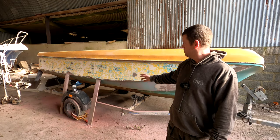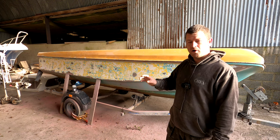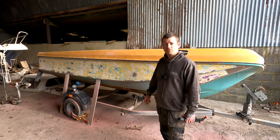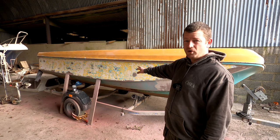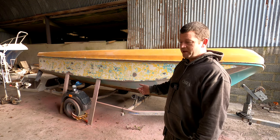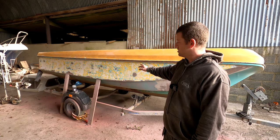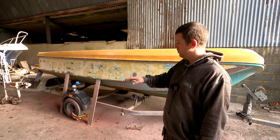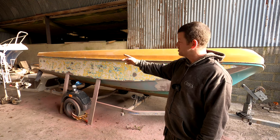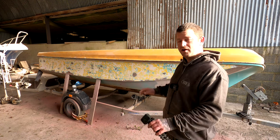After that time lapse, you've seen where we've got to. The other side we sanded straight back to the gel coat, leaving just a little bit of white primer as a guide coat. This side we've taken off the top three coats, leaving about three or four more coats of paint. The top three are a nightmare to sand but these lower ones come off pretty easy. Sanding the other side at one square foot was taking about an hour, which was really disheartening. So I told my mate Mark: take the top three layers off and keep moving along. We did that in three or four hours. I found a few little bits of damage — nothing major — and I'm going to go in closer to show you.